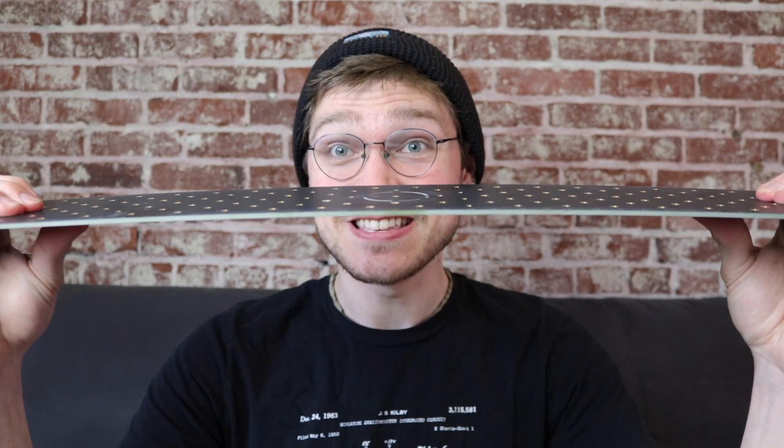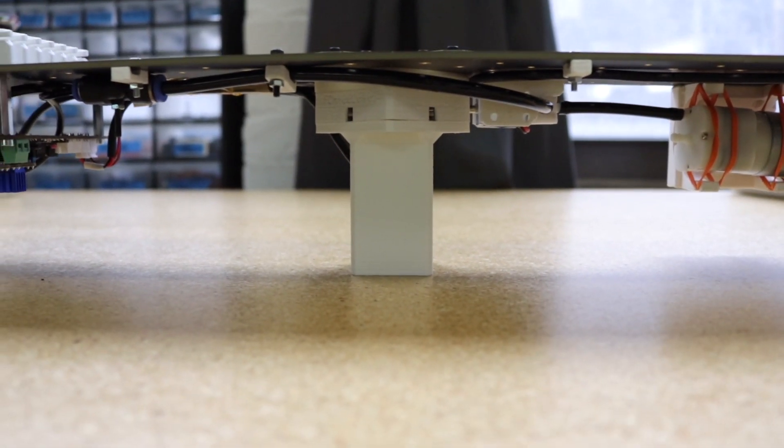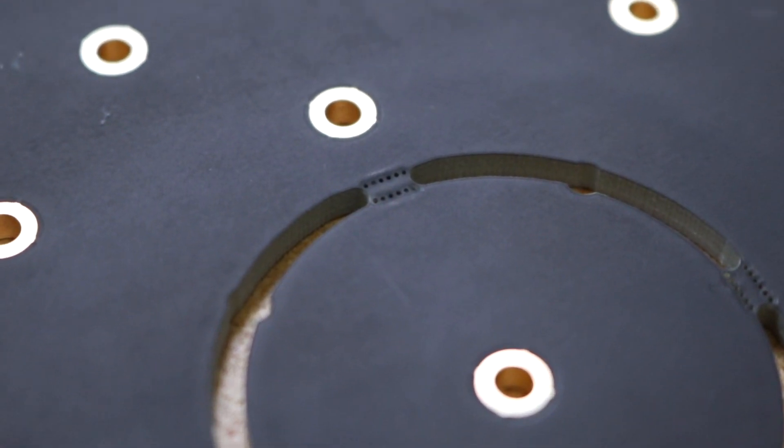FR4 at three millimeters, though, is really good. I can really flex it and it's really not moving at all. It is a little bit more flexy than the steel staging plate, but that's why we have the foot 3D print, which goes underneath the bottom camera and just breaks up this big bridge into two much smaller ones, and there is no flex with that. We also don't have the cutout for the bottom camera removed by default — it's in there with mouse bites. This means you can get this thing and use it as a build plate for more build area, adding more feeders or supporting a bigger board. Or you can just punch this thing out with some flush snips, so this one PCB can dual-act as more build area or your original staging plate.